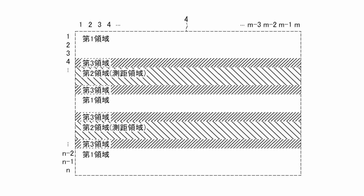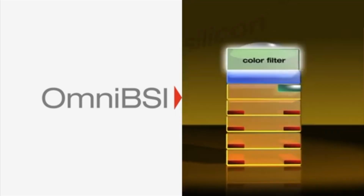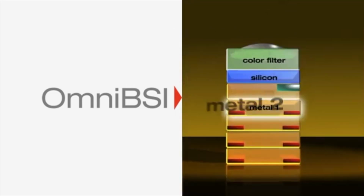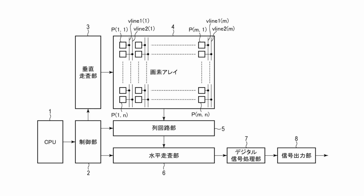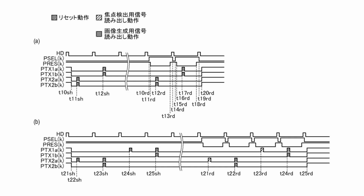All right. So imagine each pixel is actually 2 subpixels under a single microlens. Now, the microlens is a small lens covering the photosite, directing light into the electron wells. And if the sensor collects too much light in any particular well, that pixel ends up being blown out. Well, the highlight's blown out. Don't collect enough information in that particular well, then that pixel gets an awful lot of noise in the shadows.